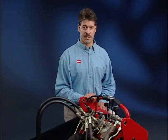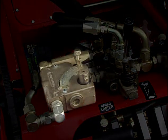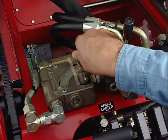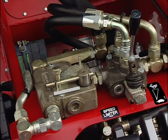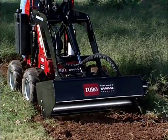The last control I want to talk about is called the hydraulic flow divider. It's located here to the left of the pump selector lever. Basically, its job is to divert flow to the auxiliary hookups. In the 12 o'clock position, no flow division takes place. As the lever is moved toward the 9 o'clock position, flow is diverted to the attachments and less is available to the wheels and loader arms. This allows for the greater concentration of power going where it's needed most.